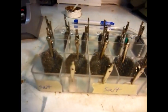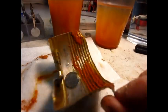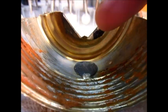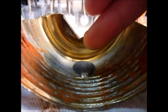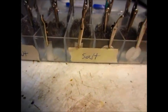There's the zinc — the camera's out of focus again. It's pitted, but not a lot. I think part of the problem is that the zinc does not produce enough voltage, because this is just plain water — it's not very conductive. So it doesn't have enough voltage to actually protect the steel very well. That's why I'm going to try salt in the next experiment.